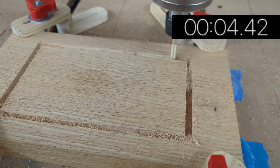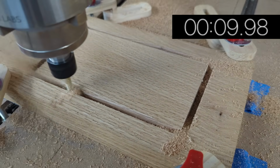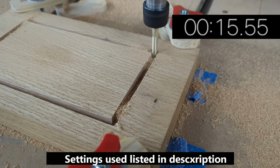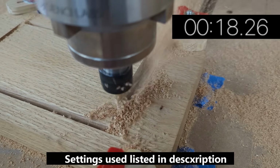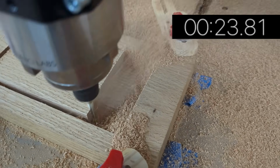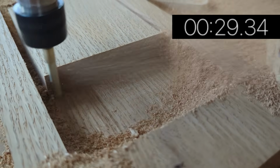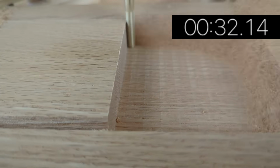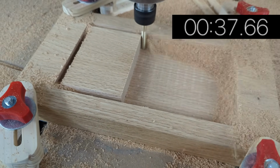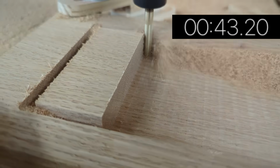Now, I've started a timer, and we are running at 300 inches per minute around this profile cut. 3 passes, and about, we're at 14 seconds later, we've created that, and now the real meat of the cut starts. We are at 3/4 of an inch deep, and we're going at an 80% step over. And now we're almost at 30 seconds into this pocket, and we're halfway done. This is the type of bit that will really remove that stuff really quick. If you've done pockets before, you know this kind of stuff takes a long time. That's exactly why this bit exists.